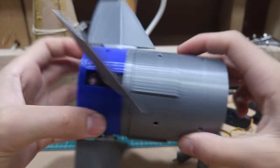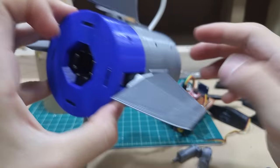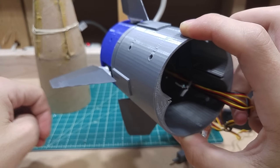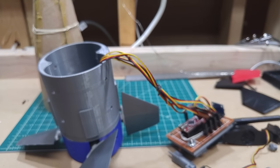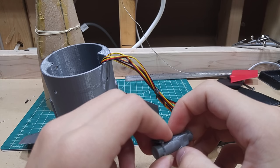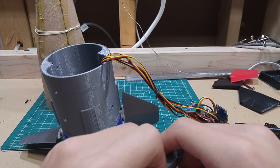My current CAD has shrunk the design down to about 1.87 inches in diameter externally, which means I can use a two-inch body tube — a full inch smaller than the current one and approximately $15 cheaper. The downsides are it's a bit more expensive overall, but I get much smaller, lighter airframes and also cheaper motors required.